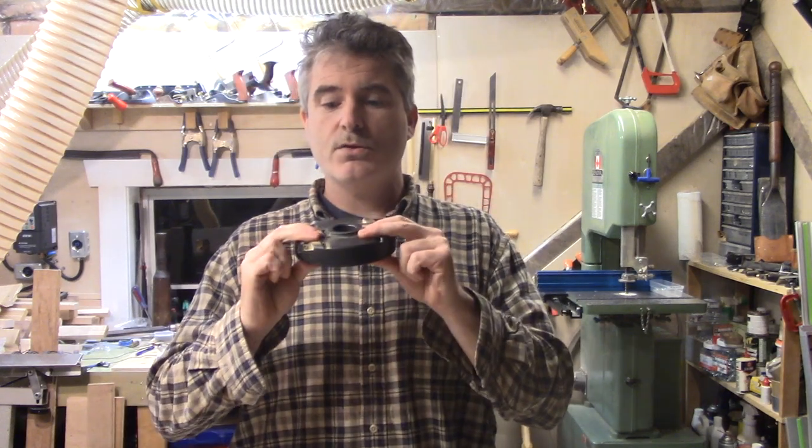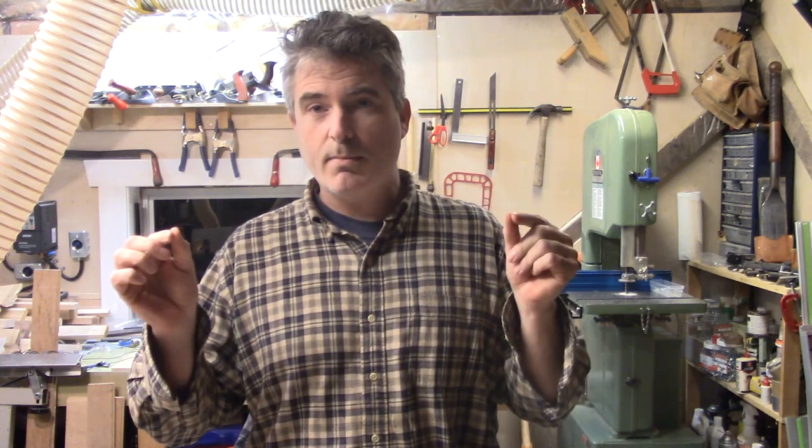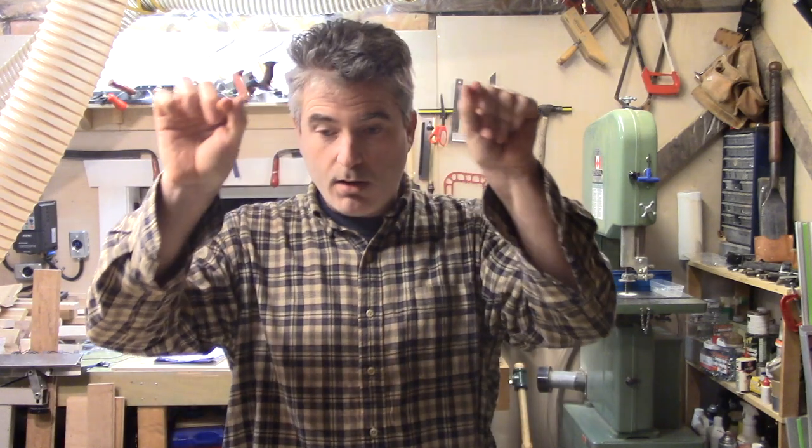Now it's time to move on to the panels, but I think that's enough video content for today. In the next video I will show the process of raising the solid maple panels using the Whitehill Tools small panel raiser, then we'll go back to the combi head and use the rebate function to put a small recess in the back of the panel so they fit into the grooves, then we'll assemble the doors and put a new set of profile knives into the combi head to do the small cove around the perimeter, then they'll be ready to finish and send off to the clients. If you enjoyed this video please give it a thumbs up, and if you have any questions go ahead and ask them in the comments below. Till the next time, thanks very much for watching.